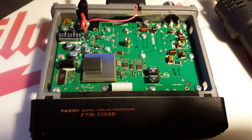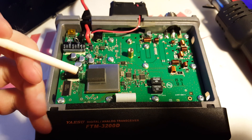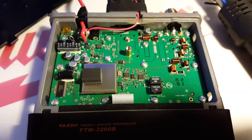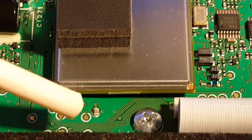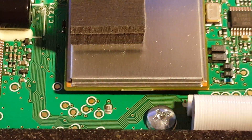I'm going to show you real quick using this chopstick here — there's a zero-ohm resistor right there. Let me zoom in a little bit for you. Right there, that little resistor right there. Pop that off and it should be fine.